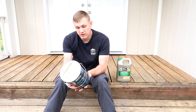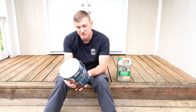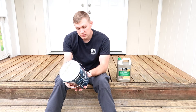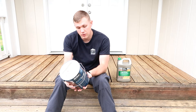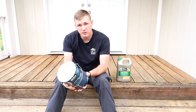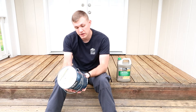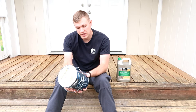For application, use the product when air and surface temperatures are between 50 and 90 degrees. Avoid applying in direct sunlight or to hot surfaces, and do not use if rain is expected within 24 hours. The surface must be completely dry before application. Avoid painting if humidity is expected to be greater than 80%. Intermix multiple containers to ensure color uniformity, and stir the product occasionally throughout application. Do not thin the product. For nail holes and cracks up to a quarter inch, completely fill in with the textured Deckover coating using a nylon polyester brush and allow to dry prior to rolling. We're going for the extra textured finish.